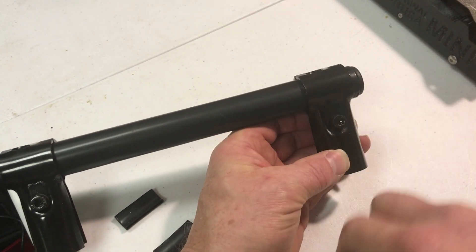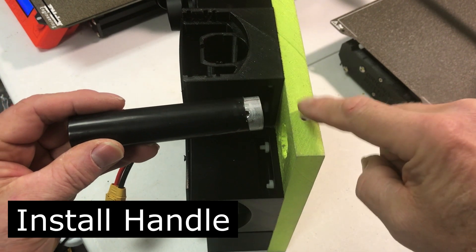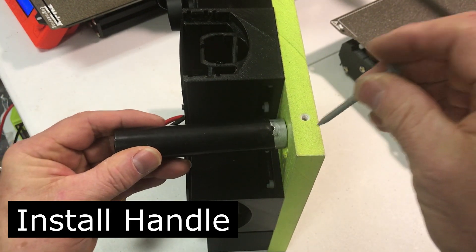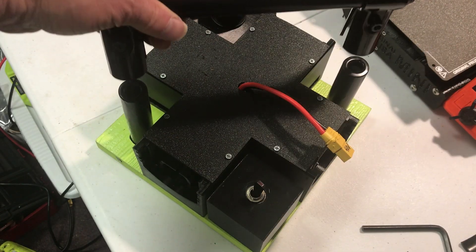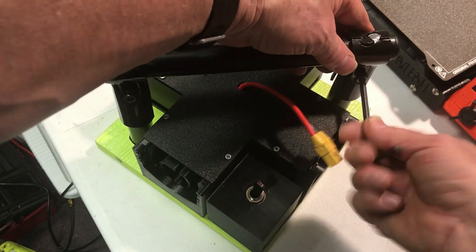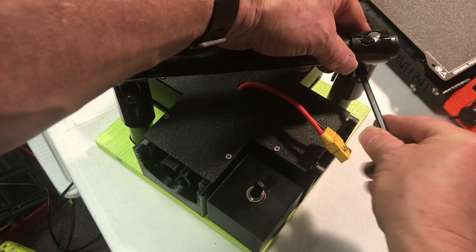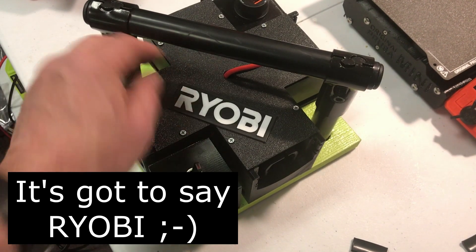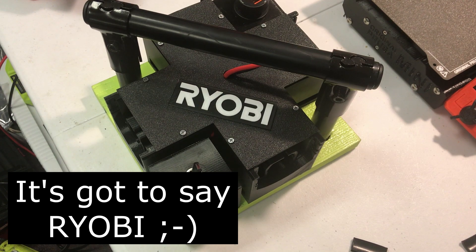Since the handle is coated, I've removed the little sleeves. To attach the handle, I've drilled a hole through the board and also through the metal pipe here. This is just going to go through and the screw is going to hold it in. I've got the handle that's going to go on here, and then I just need to tighten these with the Allen wrench. I've got a sign to put on here that I 3D printed. We should be all set.